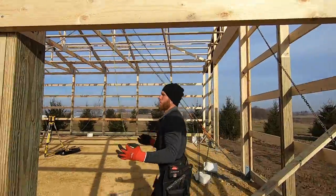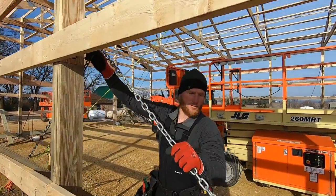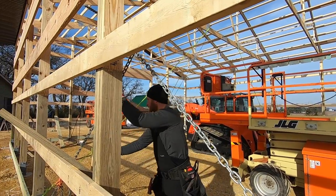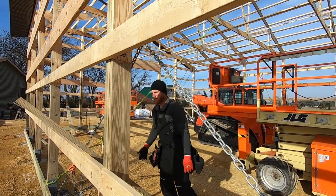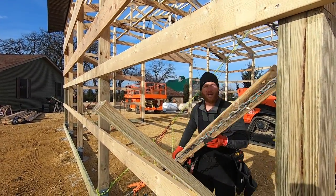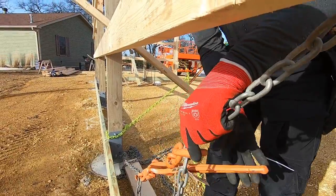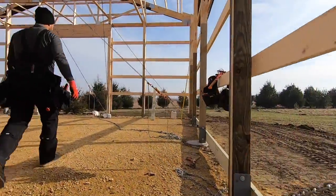In post frame construction there can be growth of a quarter inch or an eighth inch. We try to do the best we can, but when you're butting lumber up end to end there can be some discrepancies. It tells me I need to take the wall that way — not as bad, probably about a quarter of an inch. For the sake of the video and because we're a little bit OCD, I've got my chain. You can see this cross right here — a chain goes to the bottom of this column up to the top of the wall and vice versa, and I can use it to push and pull the wall any direction I want.